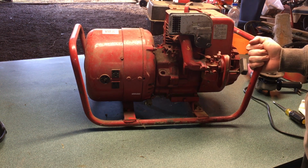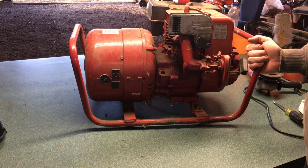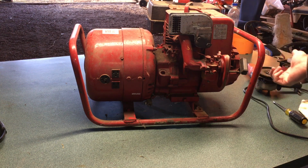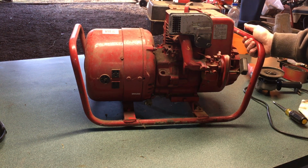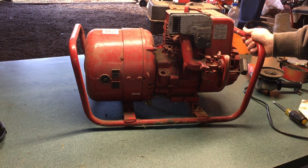So what would be next up for me, and for the videos that are coming up in the future here, of course, is we will change the oil, because that seems like a worthy project to do, and we will put some more fuel cleaner through it. I'm going to turn the gas off at this point, just because I noticed it was leaking before we actually ran it, and if there's not a constant draw of fuel out of it, it might just overflow. So if the float's not working correctly, I'll investigate getting maybe even a kit for it. But let's let the cleaner do its job. So we got Seafoam in there now. We'll run it some more, and we'll see you next time with another generator video.